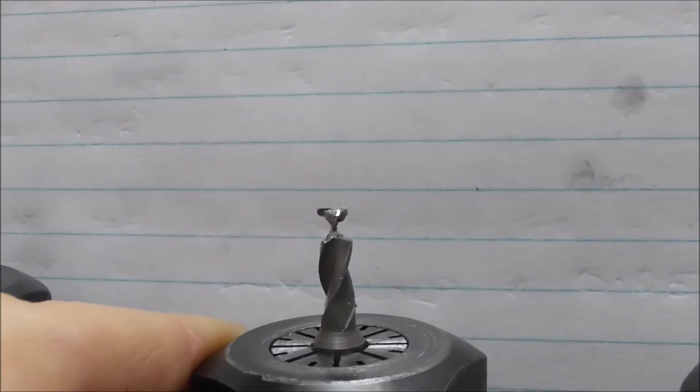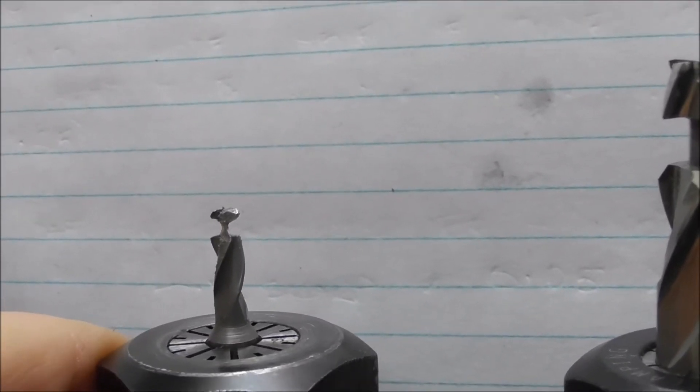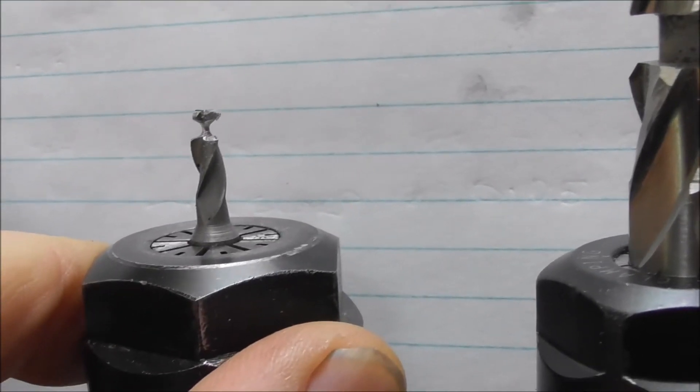Just ground on a freehand bench grinder cut-off wheel. It doesn't have to run perfectly true, provided you've got enough clearance. The clearance makes it quite a fragile cutter, only really suitable for soft materials like acetal, wood, and free-machining aluminium — it wouldn't work on steel or sticky materials. You can see the old blunt cutter with lots of clearance — it cuts really well. It might only cut on one tooth for one aspect of the geometry and another tooth for another aspect, but for certain types of work that's perfectly adequate.